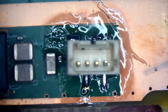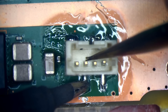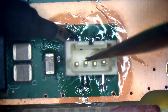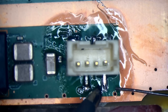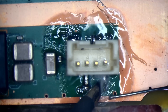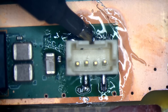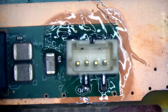That will add a little bit of strength to the connector as well. I'd rather do it that way if I can. Then I can push down on the connector, make sure it sits flat, and then if I just flow some solder on it, it should make contact with these jumpers. So we've got this one here and this one just here. Those should be done. A bit of IPA to clean up.